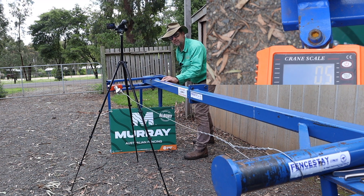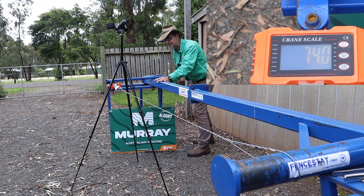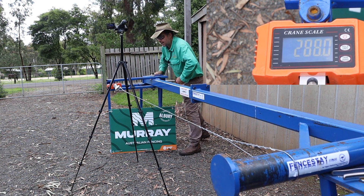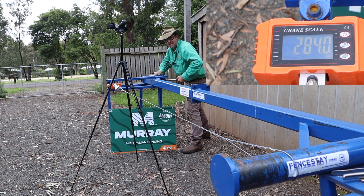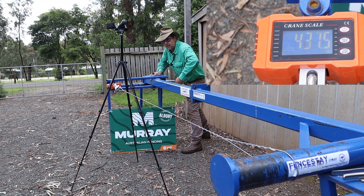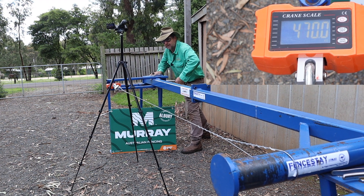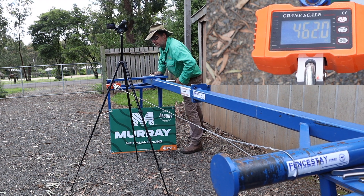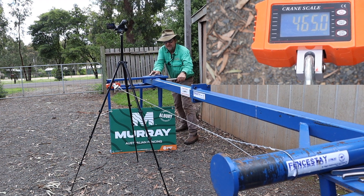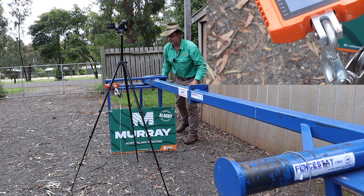Plain wire baseline. We do this every time, because wire acts differently at different temperatures, and different rolls can have slightly different results. As we're winding it up — what are we up to now? 280-odd kilos. We'll find out what the breaking strain of unbroken wire is. What are we up to now? 460-odd. Won't be too far away. This is mild tensile. There we go.